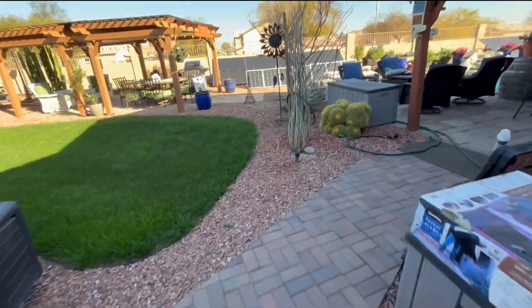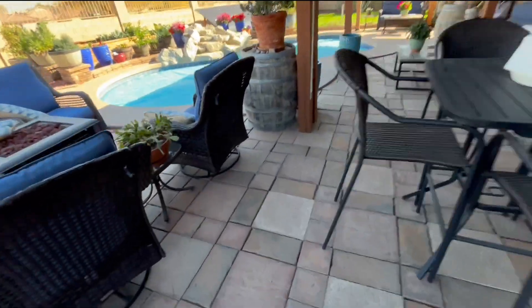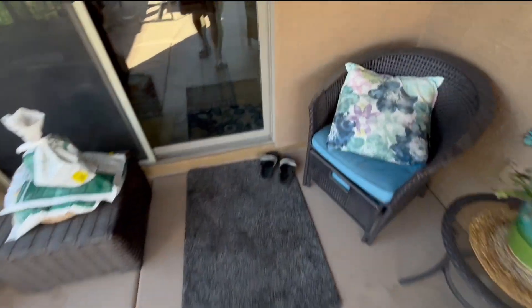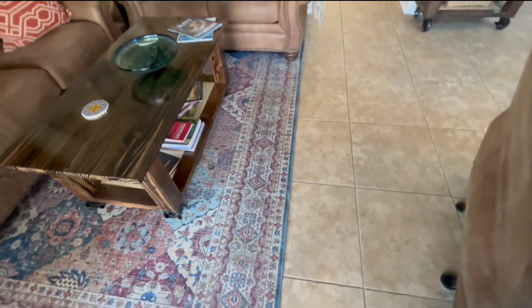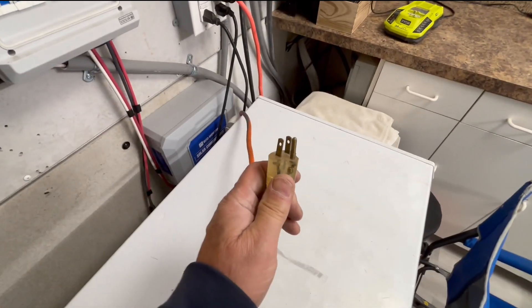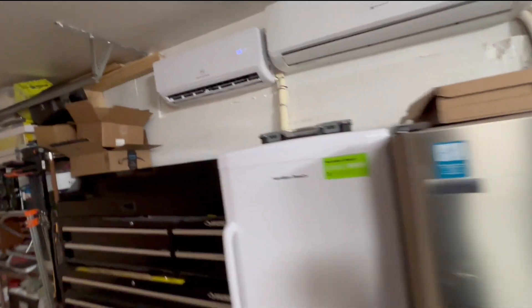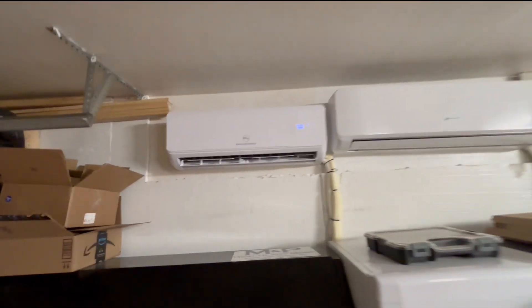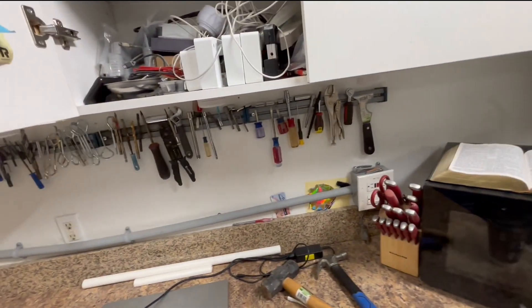We can run this directly off solar during the day. As soon as there's at least 90 volts and about 190 watts, it'll just wake up by itself if you have it on solar, and then once it gets around 230 watts it'll start air conditioning for you. We have a 12-gauge wire — white, black, and green — wired up for grid assist. Right now we're running the air conditioner with just solar, set at 70 degrees and blowing out nice cold air.